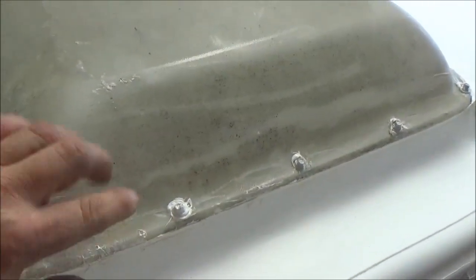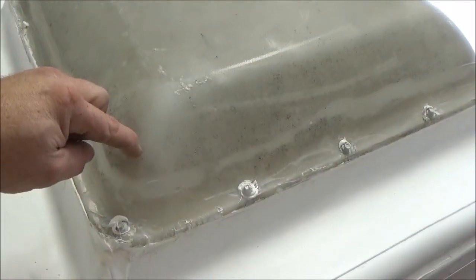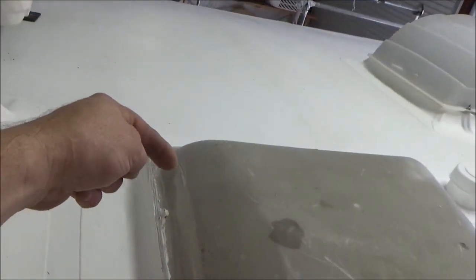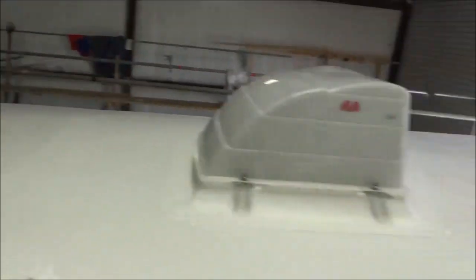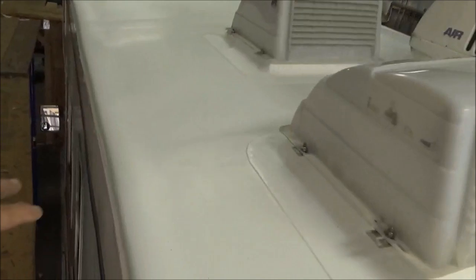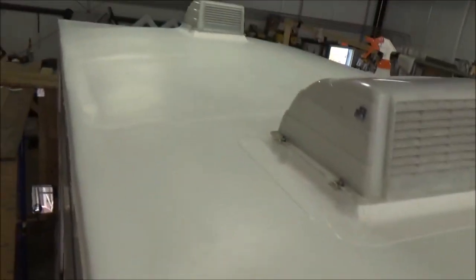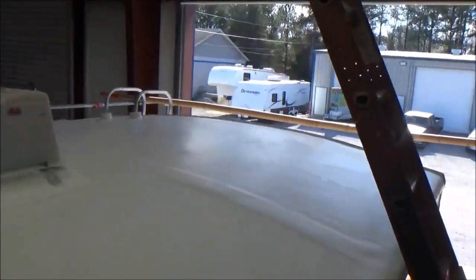So what I did was inside, if you take the lid off, inside is a counter flash piece. If it ever did get any water coming in that way, it couldn't leak inside — it's all sealed, it would have to come out. Unless it filled up so much it would burp over, but it can't leak. So I just redesigned the curbs so it would work. The stand on the back, everything else I double-caulk — two layers on there. Everything else is done, looks good, about ready to roll her out. You can see the protective strips across for joints.